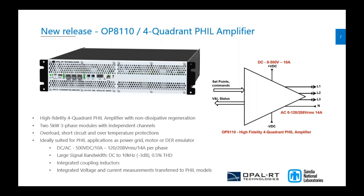The bandwidth we tested goes from DC to 100 kHz with a total harmonic distortion of 0.5%. What's really interesting about this amplifier is that we also incorporate voltage and current measurement for each phase. This is very helpful because some amplifiers don't have those measurements, requiring external high-speed sensing. In this case, everything is done inside the box and output via fiber optics to our simulator.